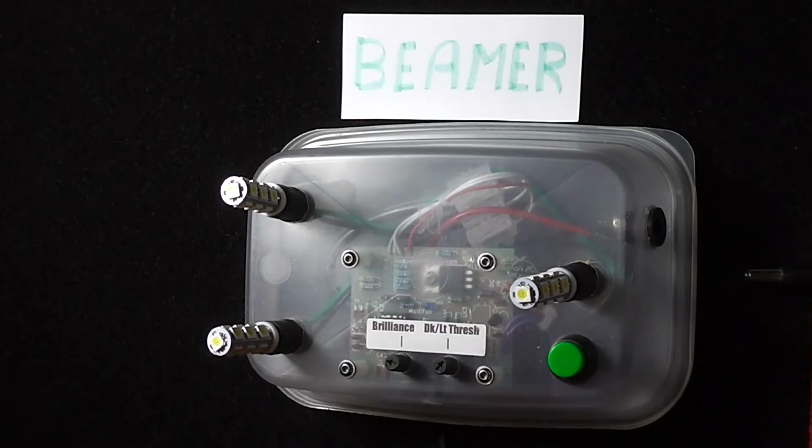At the front here is the LED sensor, the photodiode sensor, I should say. The assembly is made out of an electronic PC board support pillar, which has been drilled out to accommodate the photodiode. The photodiode is kept within an effectively dark space, and there are reasons for that, and I'll go into that later. And this is the point I found quite interesting.